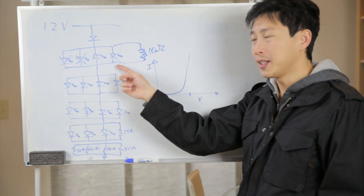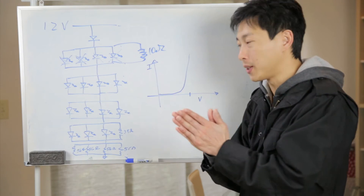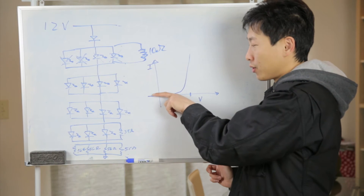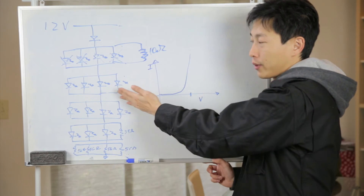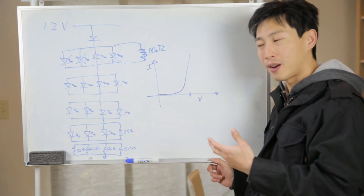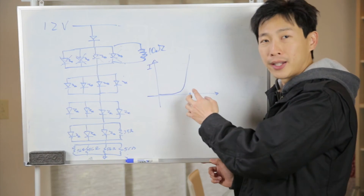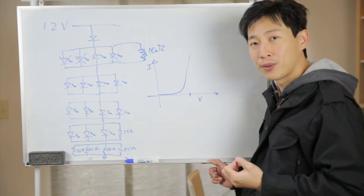Regular diodes and LED diodes operate roughly the same way. When you put a current into them, they go to a certain voltage very quickly. This is a typical diode curve — current on one axis, voltage on the other. If you increase the current just a tiny bit, it tends to lock to a certain voltage. Different LEDs have different voltages, so different color ones have a different inherent voltage. Put in a little current and boom — it's right at maybe 2 volts. Even if you put in twice as much current, it won't change the voltage much, although it will reduce the life of your LED.